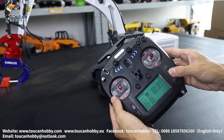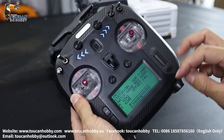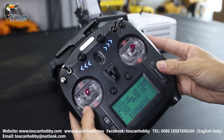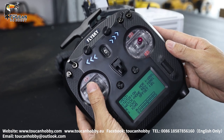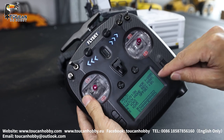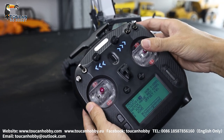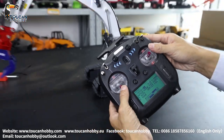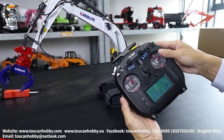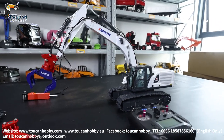Return to see mix two — all the same: on, negative 100%, 100%, zero percent. Next, mix three — that's for channel three, the front arm. So on, negative 100%, positive 100%, zero percent. Switch channel three and channel five. Okay, thank you. That's all the settings for this one. Bye-bye, we will see each other again.